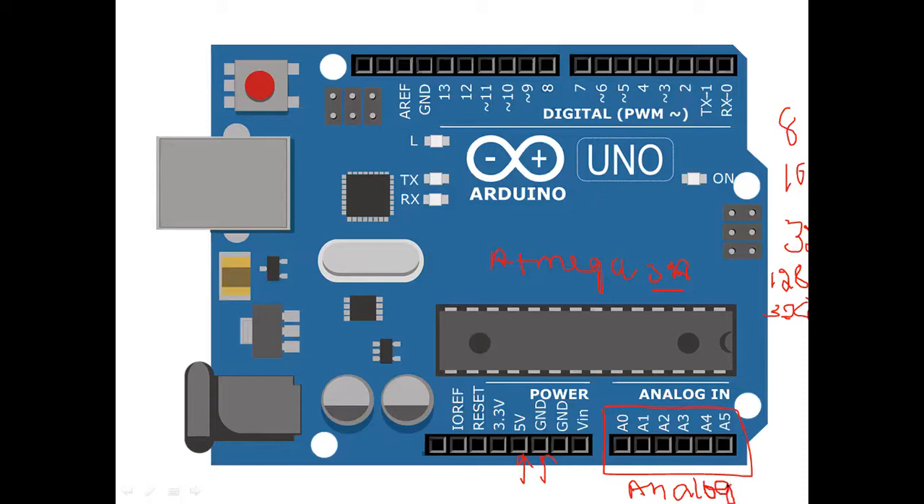To the bottom right, if you observe, there are six pins — these are all called the analog pins, A0 to A5. These are used to provide analog signals. The ATmega328 has a 10-bit ADC, so any given analog signal will be converted into its corresponding 10-bit digital code. Each channel is individual, meaning at a given instant you can provide six analog signals to Arduino, and all six will be individually converted into their corresponding digital codes.